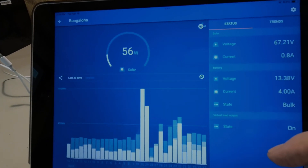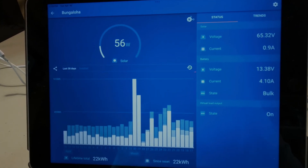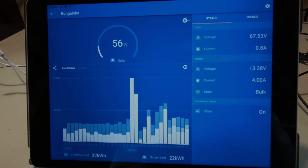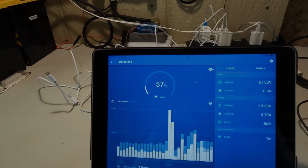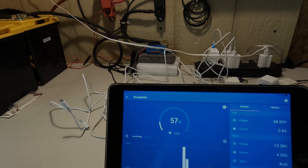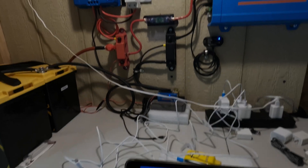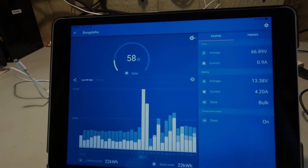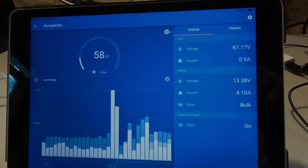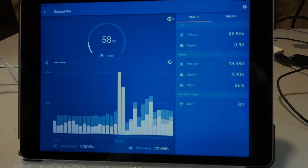Everything's looking really good. I do like those panels — I think they're going to work out great. I'm going to be showing you a lot more of those because like I said they sent out 600 watts total. I am going to tie those in series for a different experiment and review, but we're not going to run it through that charge controller because about 400 watts is about what I'm comfortable running through it, keeping that voltage under 100 volts.